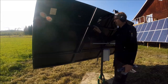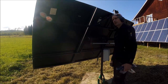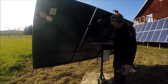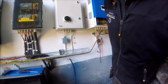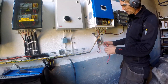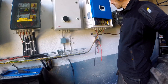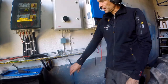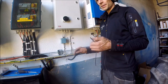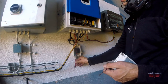Now I've done all the wiring for the solar panels. I won't connect these before I've connected inside. I'm also going to put up a safety switch so I can turn the solar panels off when not in use. Here I have the two wires from the solar panels and here I've put up this safety switch so I can turn the panels off if I need to do wiring. And here is the 12 volt cable for the sun tracker system.